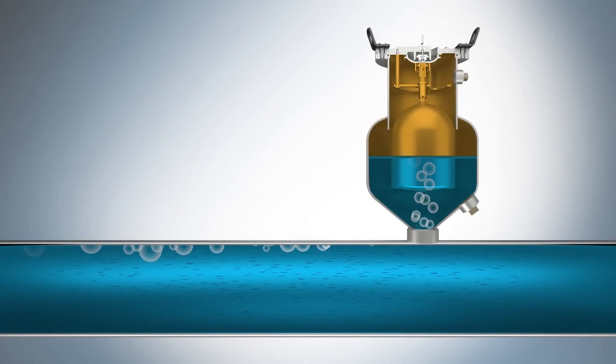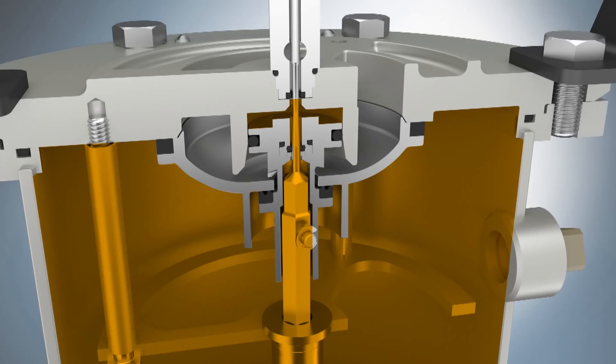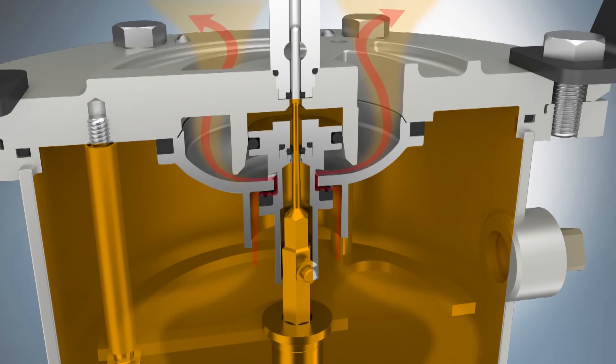If a larger amount of air collects in the pipeline during normal operation and enters the valve, it causes the float and float shaft to move down even farther, causing the upper part of the float shaft to seal off the piston chamber. Trapped air continues to accumulate in the piston chamber, causing a pressure imbalance. The piston moves down, allowing the valve to release a larger amount of air past the piston stem and seat.